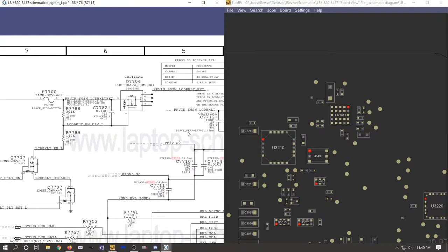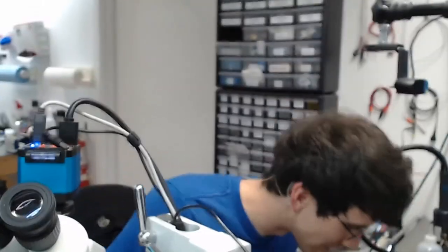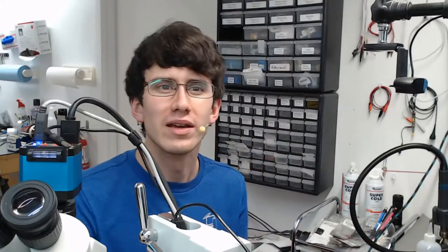You know what it is? I did not replace the fuse. There's literally no fuse. So yeah, I can actually see with the naked eye. Let's see, did you measure with screen open? I did. Can't measure backlight with lid down.